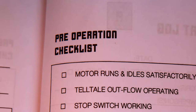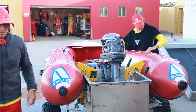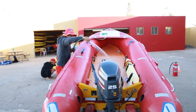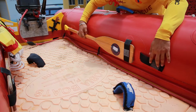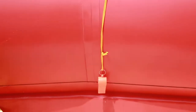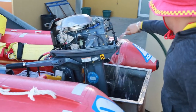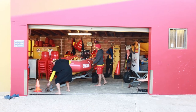In this video you've seen some of the ways an IRB team can work together to prepare and maintain the boat. We've seen that the crew can take responsibility for checking the hull and washing it down and also the five pieces of ancillary equipment: the rescue tube, paddles, tow rope, knife and whistle. We've also seen that the motor is checked and run before and after operations and that it is cleaned and sprayed before being stowed in a rescue ready state.